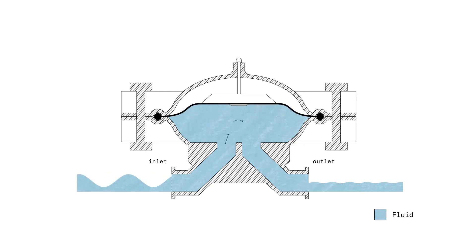We just saw the picture with the multi-stage pump and the nice green vessel. Here we have exactly that type of vessel. Let me tell you how it works. On the left side, we see a pulsating flow — that could be a pump that is pulsating. Let's assume this is a hose pump. The pump pumps, stops, pumps, stops — that's the nature of the pump. With that, we get different pressure and different flow, and you can see that in the pattern of the liquid. It is a very nice waveform: a high point means a lot of liquid, and a low point means there's no pressure.